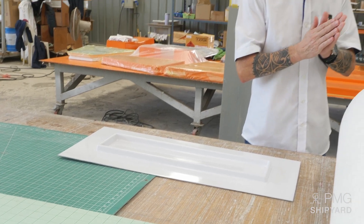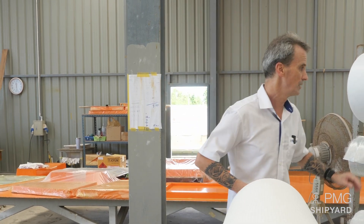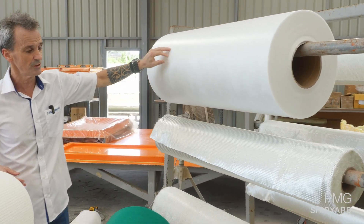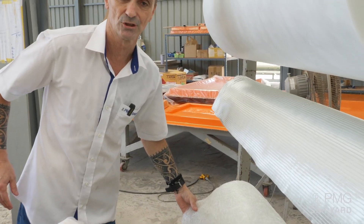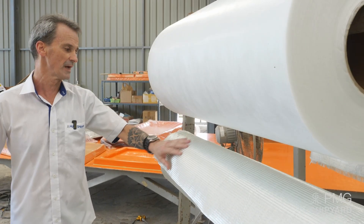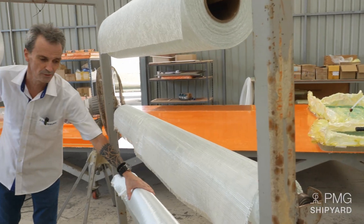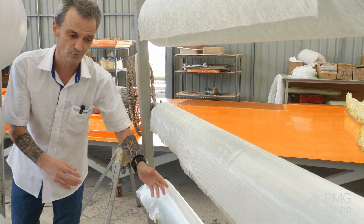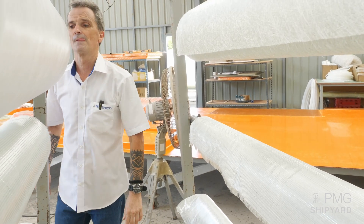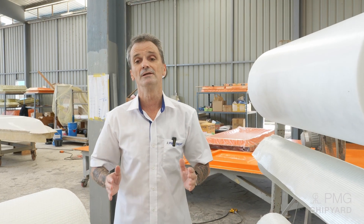All the materials used for the Cora hull and all products that go into the Cora are vacuum infused — the whole boat is vacuum infused. This is the tie layer material, used to stop osmosis, and we do this hand lamination with a vinyl ester resin. For the rest of the layup materials, depending on the layer required, we have material in 0/90 orientation, some in plus and minus 45 degrees — a mix of directions — depending on where and what layer is required.